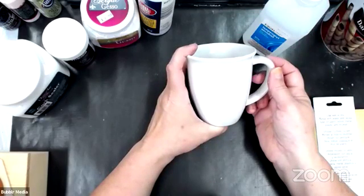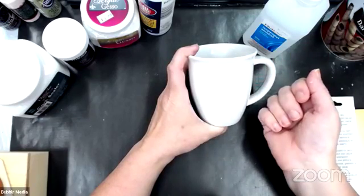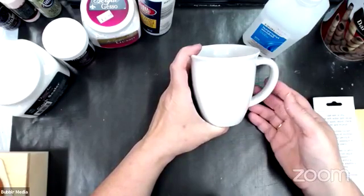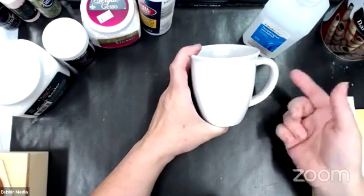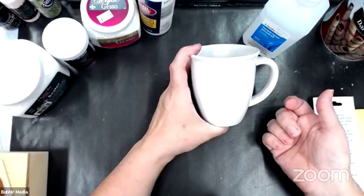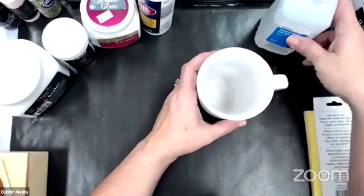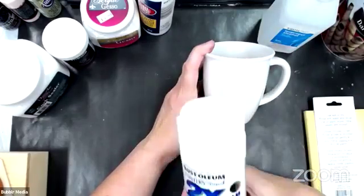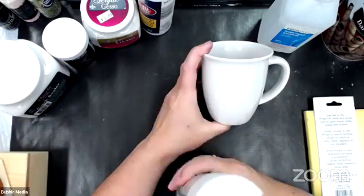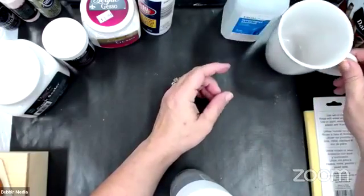The reason why we're cleaning the metal off is because our fingers have touched it, and our fingers are full of oil. Think of Thompson deck sealer — when it rains, all the water bubbles up. Well, that's what's going to happen here. The paint you use is going to bubble up because it's not going to adhere to the oils from your fingers. That's why we need to wash those surfaces off really well. You could also spray this with some Rust-Oleum primer or other sprays available to prep that for your project.